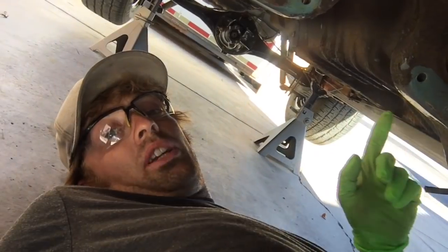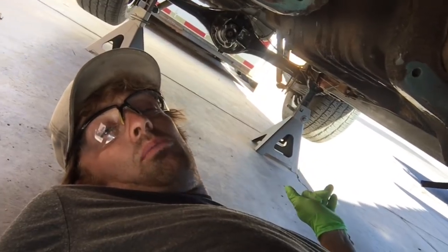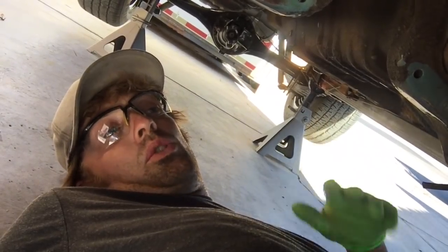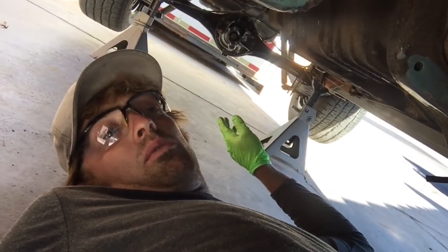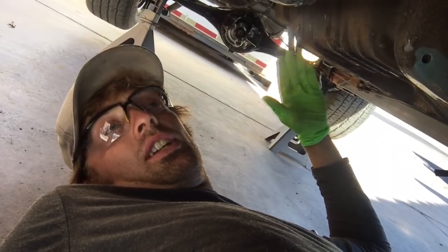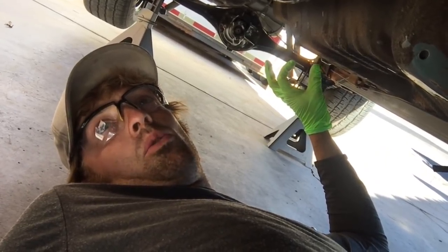The exhaust manifolds were already ceramic coated. Oh, I ordered my exhaust system for this car. I got a full stainless exhaust for it, or I had to make it, but it's all in pieces. I got Borla mufflers, stainless Borlas, 2.5 inch, and all the stainless pipe I need to build the full exhaust. I'm gonna make an X pipe for it over the axle and out. I'm gonna put the factory tips on it. I'm just gonna cut the back of the tips off so I can weld the 2.5 inch to it, because I'm not gonna neck it down to 2.25.